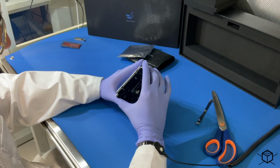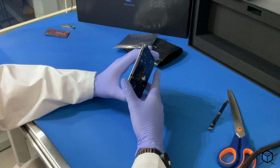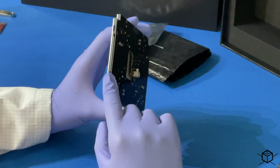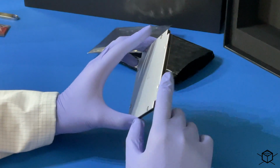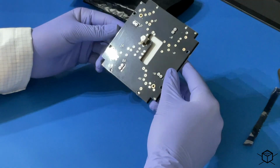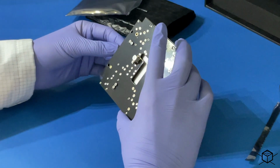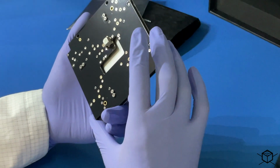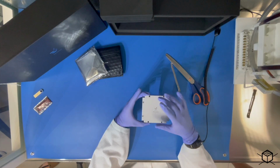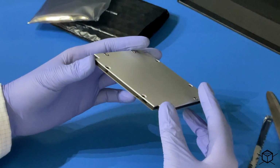but we can clearly see that the antenna is also hard anodized on the side. We cannot see right now the rods because they are not deployed, but these are made from a shape memory alloy. So when they are fully deployed, we can expect a straight line. Yeah, we can see here a line. I don't know if this can be seen clearly in the video, but we have a scratch. I think not very deep, but clearly noticeable with light. We can see here the four mounting holes that are used for assembling the antenna in the structure.